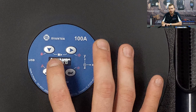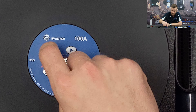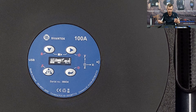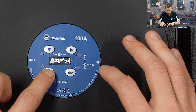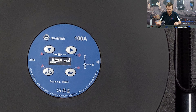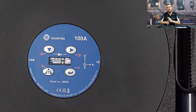Pressing those two buttons together starts the measurement and automatically locks the keyboard. To unlock it, the default sequence is clockwise — top left, top right, bottom right, bottom left. Once unlocked, you'll see a line running across the bottom indicating the instrument is running. You can scroll through displays showing X, Y, Z, VDV, AW, and C dose results.